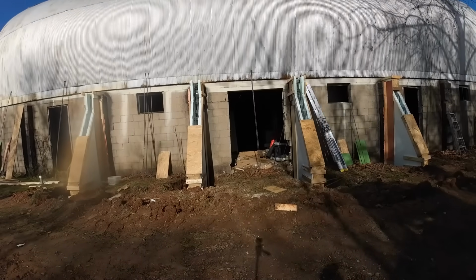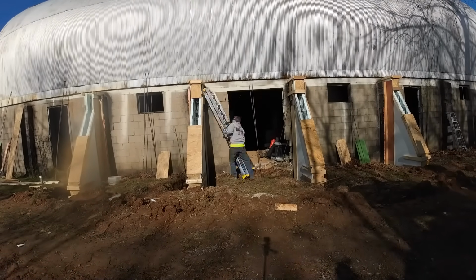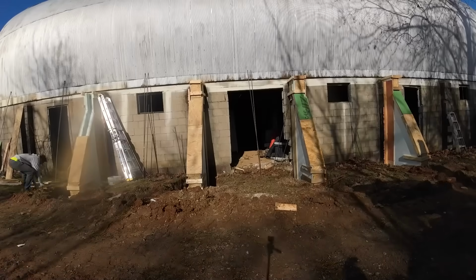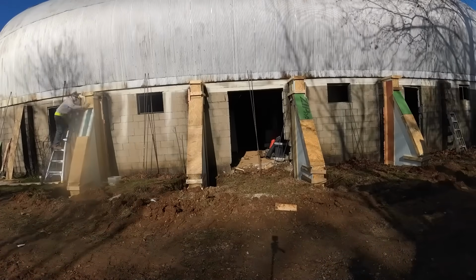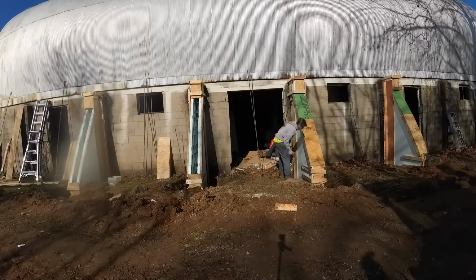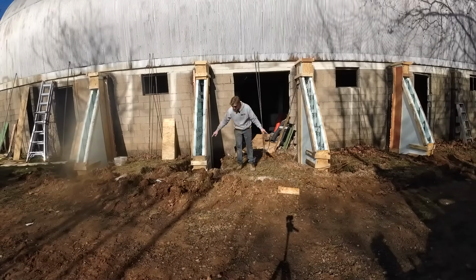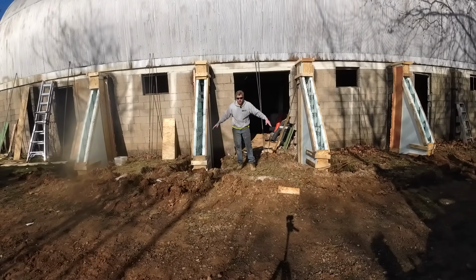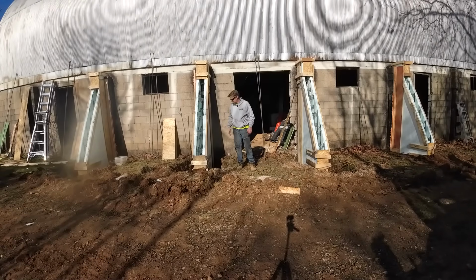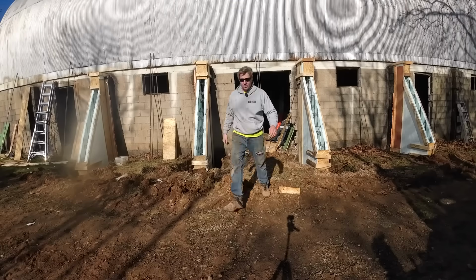Next thing I'm going to do is go ahead and just go down and pre-start all the screws on these caps. It took me about 15 minutes to get all these screws started and ready, and that's just something I don't want to mess with whenever I'm actually pouring the concrete. So this way they're prepped, staged, and ready to go. The next step we have is I got to run some braces across the front of these to keep them from getting too wild on us, and to help support that front just a little bit. It's 12:45. We're getting close though.